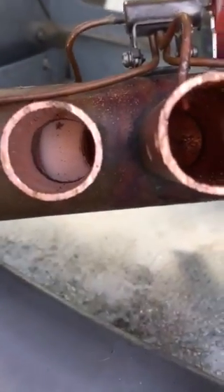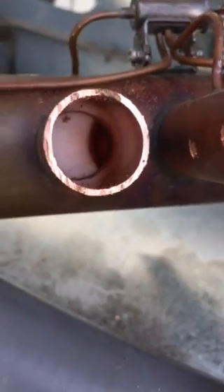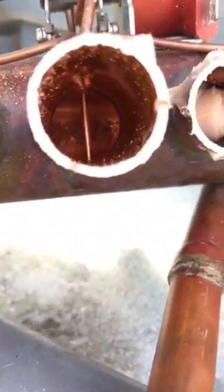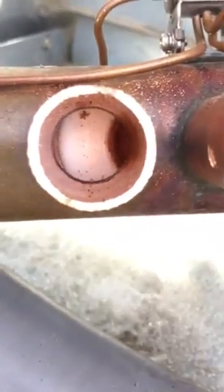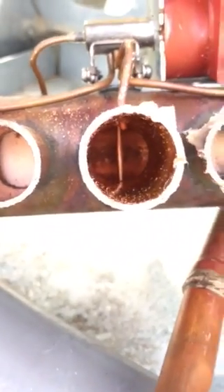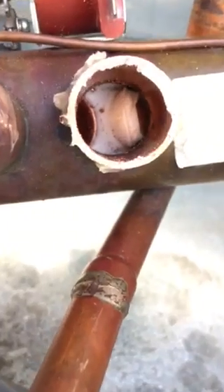I'm going to show you the inside of this valve. On this side you can see the Teflon seal — I cut the valve off at the top where the top ports are, and you can see that Teflon seal in there. That's a good seal. This is the line-to-line port right here. This port is the larger line that goes back to the evaporator coil in cooling, your suction line. This center line actually goes directly to the compressor.